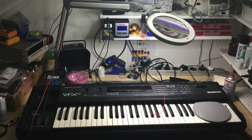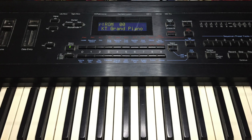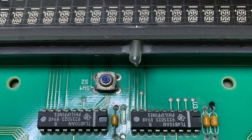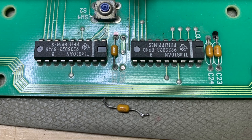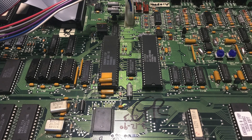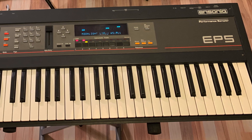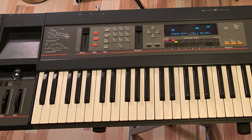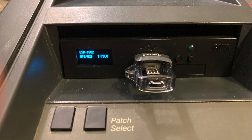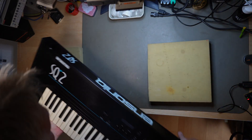Like I had a VFX-SD which didn't work at all, or a KT-76 which seemed to be working but had no sound and I could not find the culprit, and another VFX-SD which I got working again after finding a shorted capacitor on the display board, but it had a broken effect chip and other IC problems I could not diagnose back then. And then finally success with an EPS sampler — the classic version — which needed a power supply repair, some new tactile switches, and I replaced the floppy drive with a GoTek floppy disk emulator.